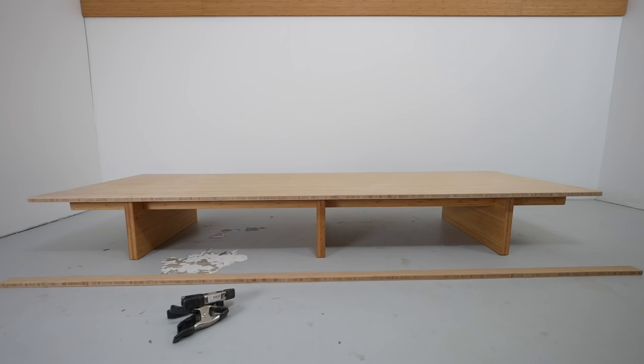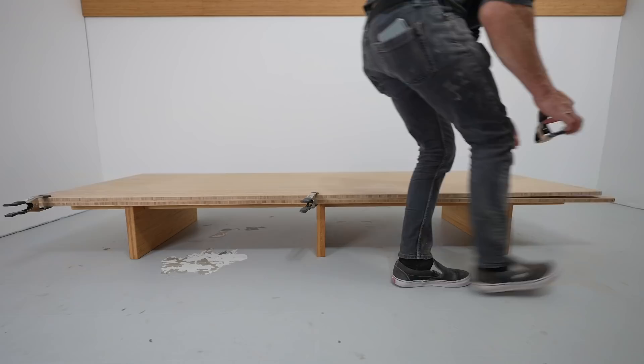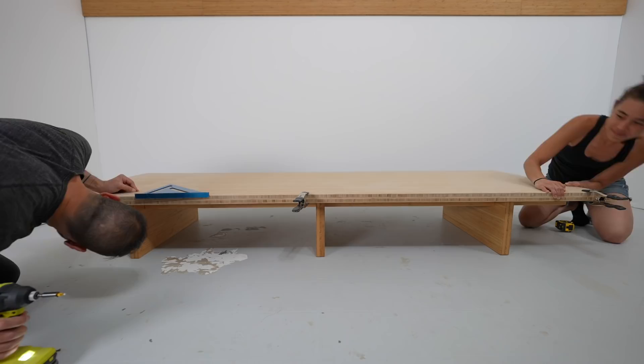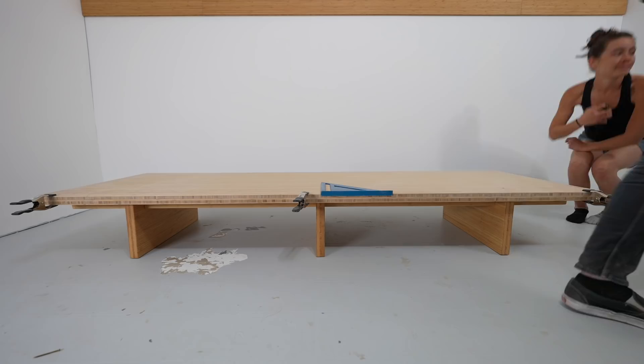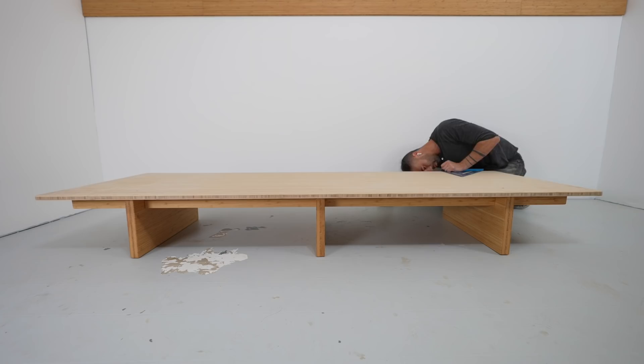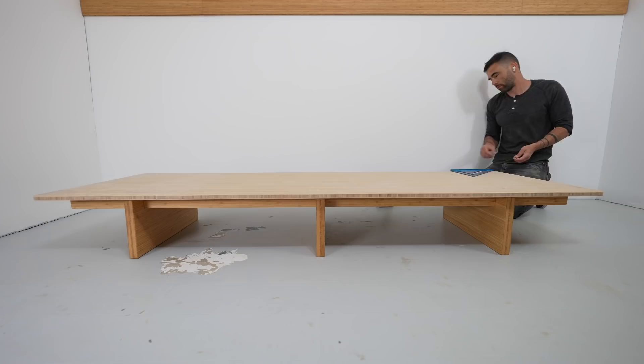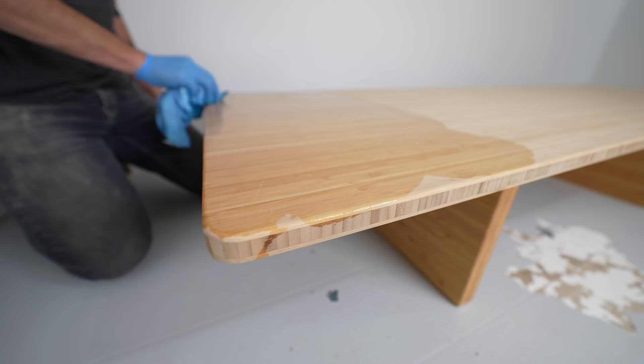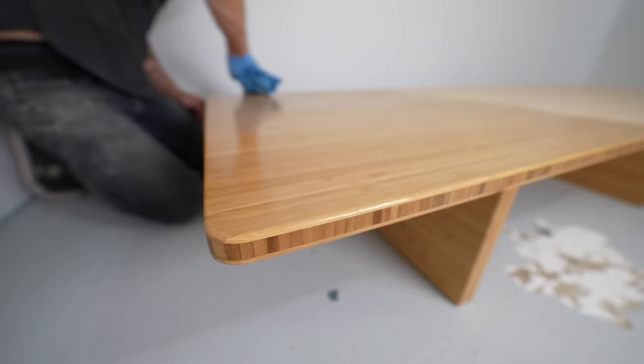I then added the big board that will support the cushion. I made sure to get it nice and centered over the base and to make this a little bit easier I clamped a spacer strip of plywood to the front — that way all me and Jesse had to do was just line up the ends. I designed it so that all three legs are underneath the cushions, so I can screw just through this top piece of plywood and all those screws will be covered by the cushions themselves. You could make it a little bit stronger by screwing through the top piece of plywood and into the stretchers that stick out past the outer legs, but it's plenty strong as it is. I'm really digging this bamboo plywood — the edge grain is just so cool looking. It almost looks like a miniature butcher's block and the simple finish really brings out this caramel color.